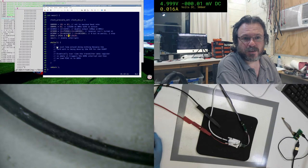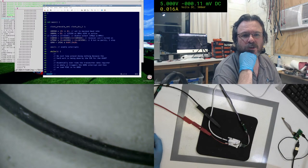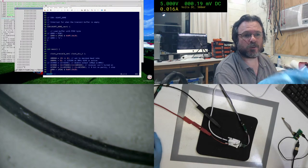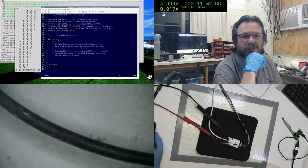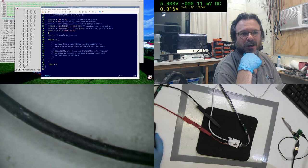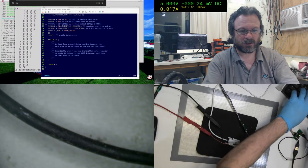Bob, the interrupts are enabled after I've set up everything. And so that shouldn't cause any problems because it wouldn't really matter whether you put it there or there. The interrupt is firing because otherwise we would not get the variation of data. The problem is something to do with the... I could do it as a while loop in here, like actually wait until the flag comes up to say that it's empty and then load it. But you're wasting time there.